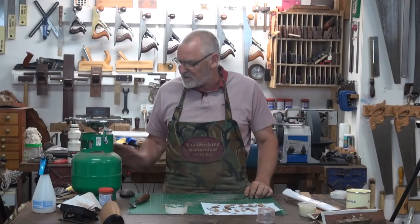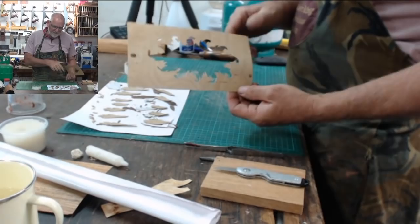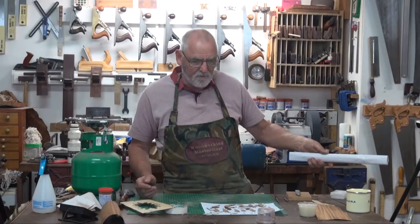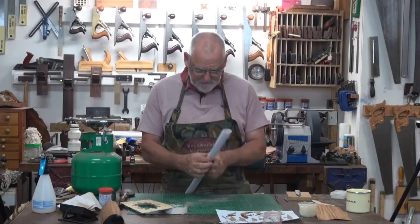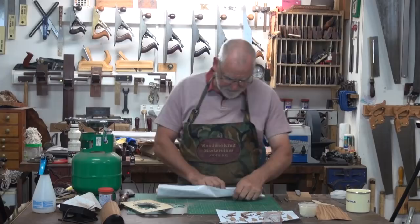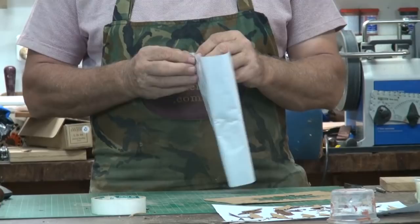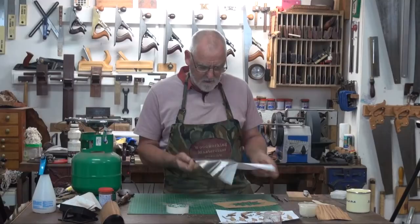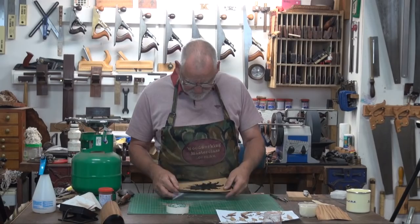That's the basic thing — this is just an ordinary gas cylinder. This is one part of the inside, and I have another one I've already completed, so we'll see how these go together. First thing I do is get some bookbinding contact that you can buy from newsagents or office supply stores — it works a treat. Make sure your work is pretty clean. When there's a lot of little pieces, this is a really great way of holding all your work together. We're working from the back. If I do a basic marquetry course, I actually get people to work from the front because it's a lot easier.